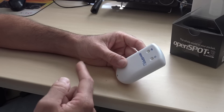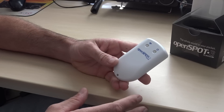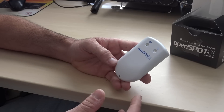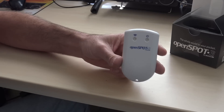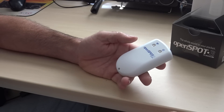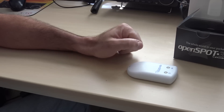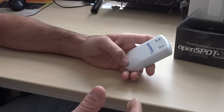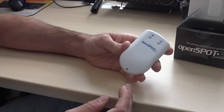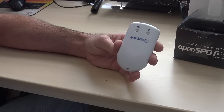POCSAG — Josh just did a video on that and I haven't really gotten into it. But you can also use this to transmit your data on a D-Star or C4FM radio to APRS.fi, so now you have APRS through this hotspot as well. It goes to the APRS database and you don't need a traditional TNC. Repeaters may be on the downfall — why would you need a repeater if you have one of these? I know, internet fails and this won't work. But as long as we're not waiting for the zombie apocalypse and you want to have fun with radio, you won't need to be in an area saturated with repeaters.